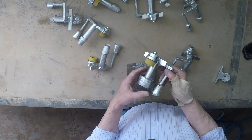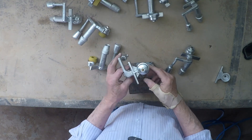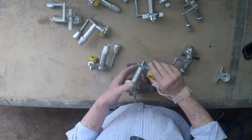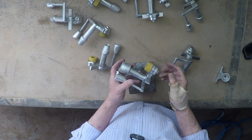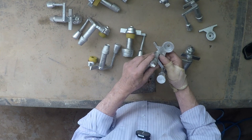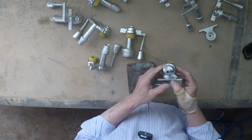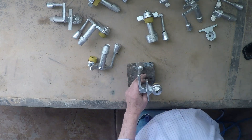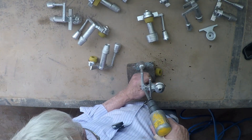Just a little follow-up on the casting of these brake fluid reservoir bases — there's a bit of a problem with them, and that is getting this core out afterwards. Whilst I have often extolled the virtues of shell cores and said that the breakdown of them is very good, they do have the Achilles heel that if the core is thick and the casting thin, there's not really enough heat to cook the core off, and breakdown becomes very poor. It is in fact quite difficult to get these cores out of the casting. I started last night, and after 10 minutes at one of them with a screwdriver and a cold chisel I thought no, that's nonsense. So what I now do: first of all I drill through there where you can see the core protruding, with a masonry drill, and then we go for this rather noisy device — we have to make certain we don't jab ourselves in the hand.